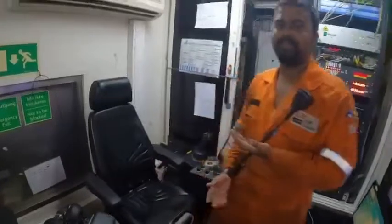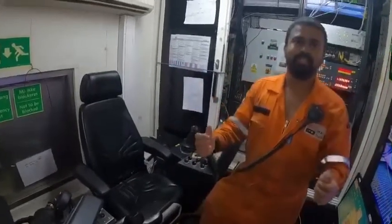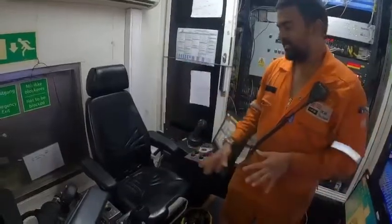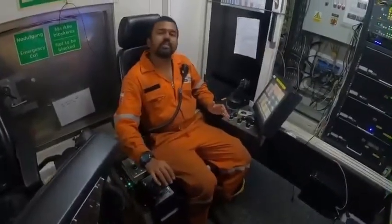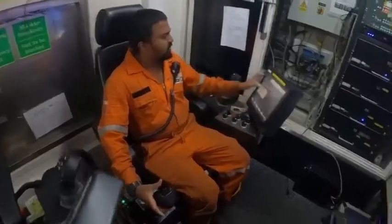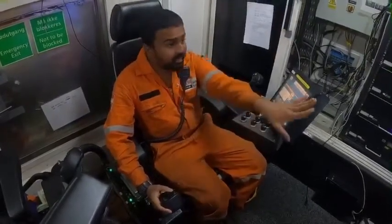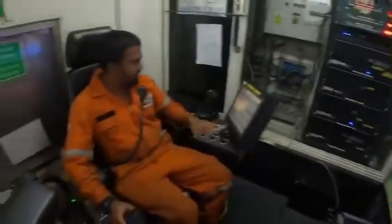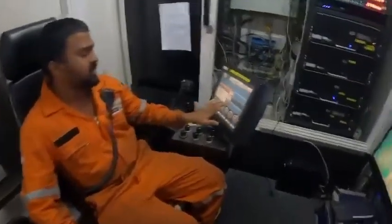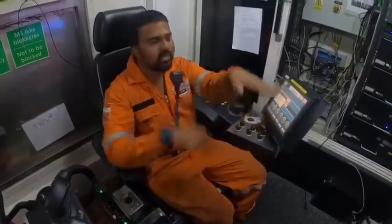This is what we call a pilot chair. It's a more luxury version compared to the conventional setup where you just sit at a desk. This is a totally integrated pilot chair with everything built in. This joystick controls the ROV — forward, reverse, turn clockwise, counter-clockwise, up and down, including camera pan and tilt — all controlled from here. This unit controls camera up and down. We also have our station-keeping functions here. When we press this, the ROV will maintain the same heading, and we can choose the same altitude so the ROV can hold its position.